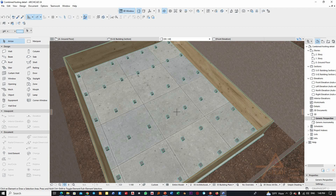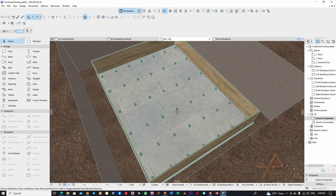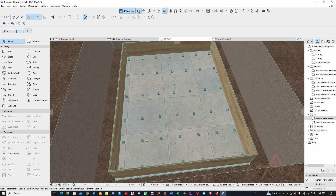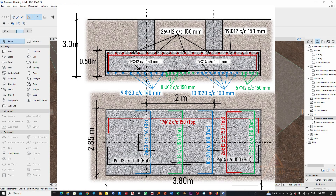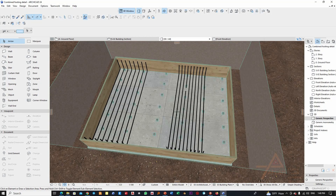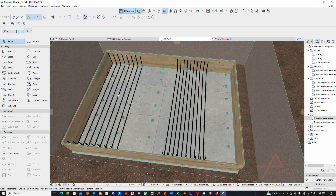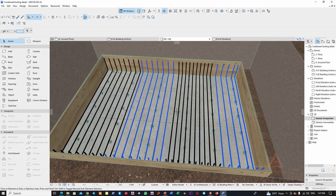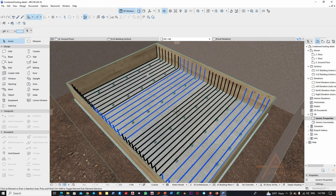After this, you will provide the bottom reinforcements — first in the B direction, then the top reinforcements. The reinforcement in the B direction is placed first. Under column two we place the 5Ø20 bars, and under column one as well. The reinforcement in the regions between the columns uses the minimum reinforcement of 5Ø12 at 150mm spacing. The critical section in the B direction uses 5Ø12, and the column zones use 5Ø20.